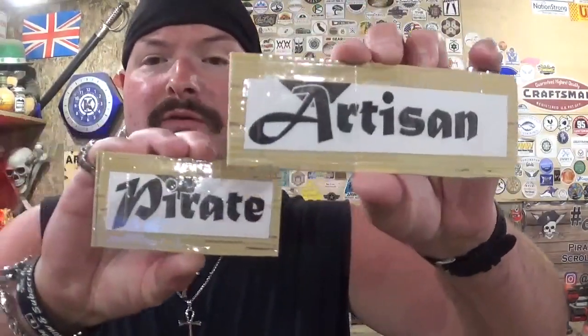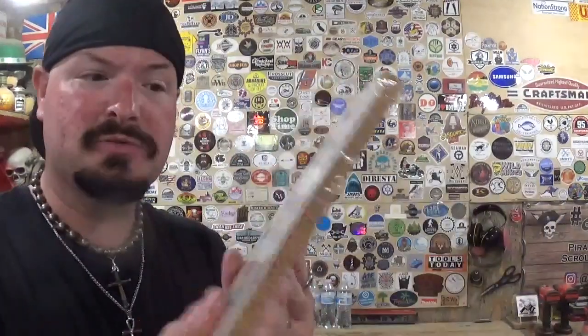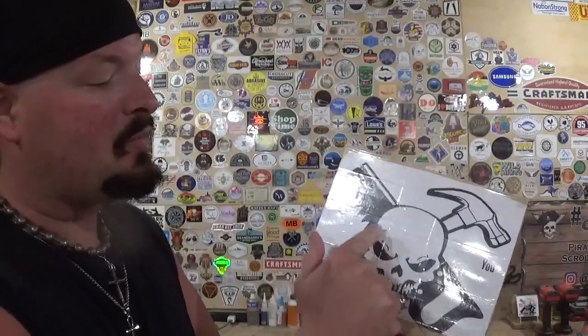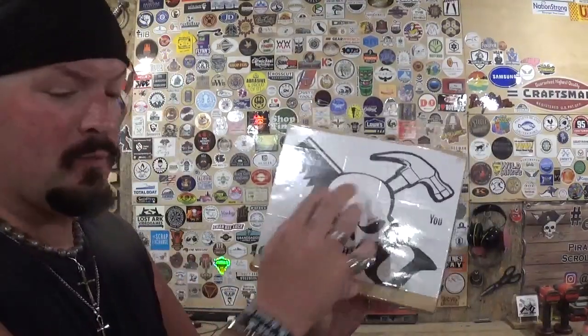But really cool. As I said, I've already got it enlarged to a 2-page pattern, and we're going to cut my name out of just scrap 1/4 inch material. This is the 1/4 inch material I have been using throughout, and we will cut this out, and I'm going to paint it, and I'm going to probably change the colors in some of it just to give it some contrast. We have some 1/2 inch material here for the Jolly Roger skull and crossbones, and there's going to be some floaters in this project, meaning that the eyes, and I don't know if I'm going to be able to save the eyebrows because they're so thin, and the nose, those will be cut out completely and then glued back in once everything is painted. But this is 1/2 inch material, and we will cut that out.